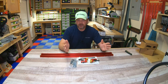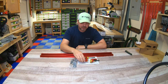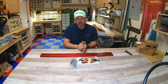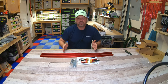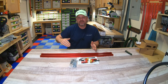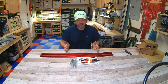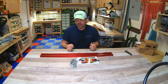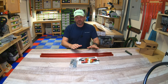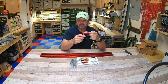If I had this when I started that project, I would have set one of these stops to 12 inches, and I know that if I had to come back two or three days later and cut another piece at that same width, I'd just flip this up and it would have been set already. This is really useful — when you start your project, if you know the dimensions you have to cut, you can go ahead and set two of these stops up so you always have those as reference points if you ever have to come back a few days later.